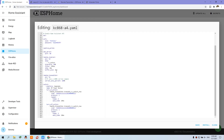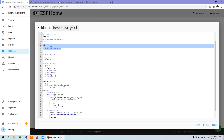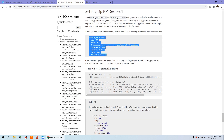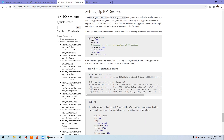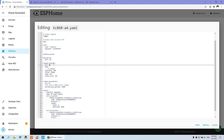You can see I have already copied it. You just replace the Wi-Fi SSID and the password of your network. And this is the remote receiver. You can see this is the ESPHome configuration for using the RF device — this is for RF transmit. You can see this is for IR and this is RF. So you need to define the remote receiver. For this pin, you need to change it to whichever GPIO you have used. The 'dump' option captures all data — you do not need to change the buffer and signal settings. Just copy this from the ESPHome official website. I have already copied this, and the receive pin is 19.